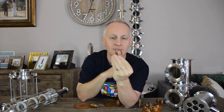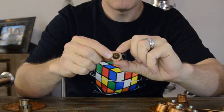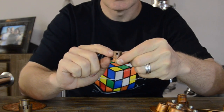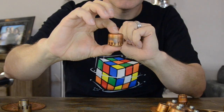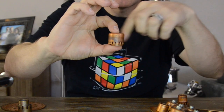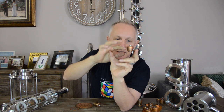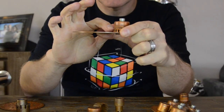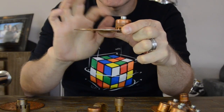Take this bubble cap that I have here. Vapor will pass from the bottom up into the riser and come out of these small holes. With the cap on top, that vapor will now force back down and exit through the serrated edge over the slots on the side. Adding the bubble cap to a tray, the vapor will start to condense and eventually build up on this plate. As it rises, it will go over and above those serrated slots and the vapor will pass through the liquid as it goes up.